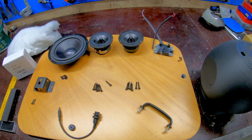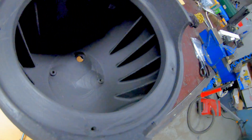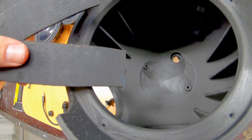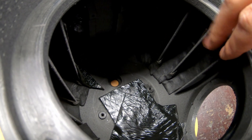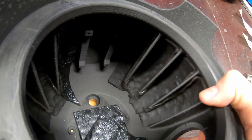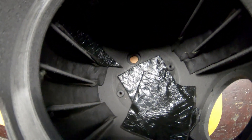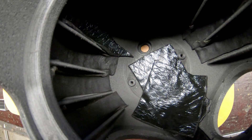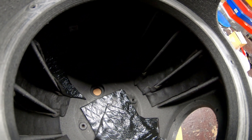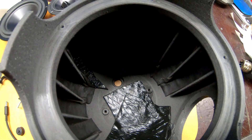What we're going to do first is insert some bitumen sheets — we have these stiffeners here. We're going to heat these bitumen sheets and bond them on the inside of the enclosure. It doesn't have to be pretty because this won't be visible from the outside. Use whatever scrap pieces you have, and try to push them all the way against all the edges so they're properly coupled to the enclosure. Avoid the cheapest bitumen as it can be quite brittle when heated. STP brand works nicely — get the thickest one you can find, four millimeters should be available. You can try a knuckle test to hear the difference it makes.